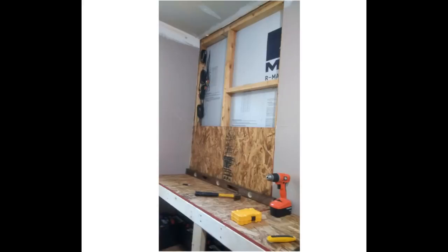This is just basic construction — two-by-fours and plywood. There's a desk there, and in the bottom there's gonna be battery storage with a door and two 12-volt DC fans — like you see on the back of a computer — one pulling in and one pulling out to the outside wall, to ventilate the battery compartment under the desk, because you're going to have some fumes.